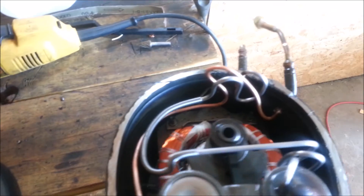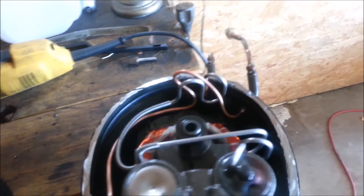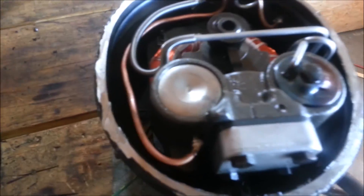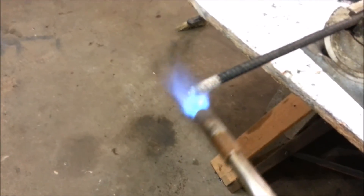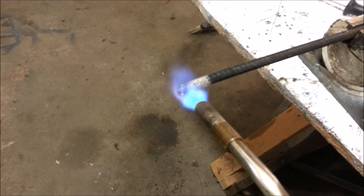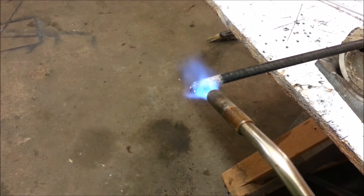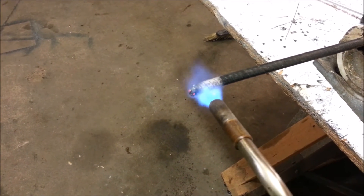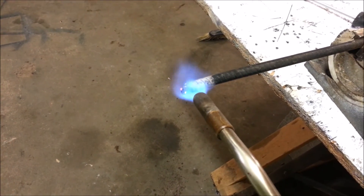I have the copper intake line connected — it's not quite as pretty as the discharge, but this is going to be an open head unit, as far as I'm not going to weld this back together. The reason I did that is I wanted to eliminate this oil reservoir from the gas stream. That's just some oxide heating up — that's not red-hot metal.